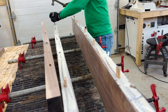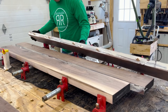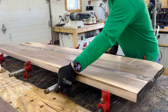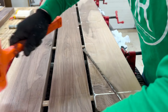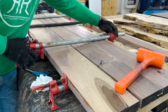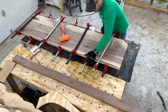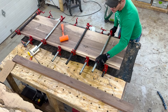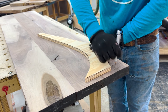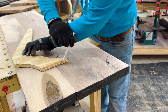Here's one of the things that changed as I developed as a woodworker. I actually started building my pieces using a Kreg jig with pocket holes and screws, and I was slow to adopt more conventional joinery. I was nervous it would take too long or be too hard. But it ended up not taking all that long when I made the switch, and it gives a much better table. The top and bottom are sealed nicely with glue, the integrity is significantly higher, and the dominoes allow me to level the boards really well. Prior to the Domino, I used a DeWalt biscuit cutter — that worked well, but I moved to the Domino for more advanced joinery work.